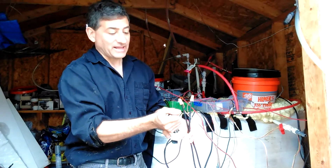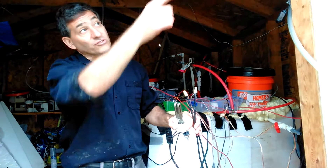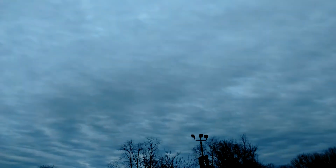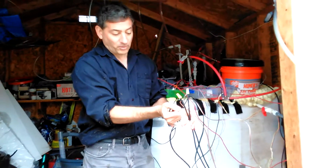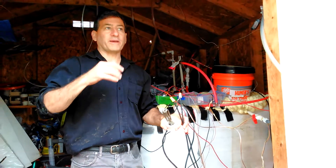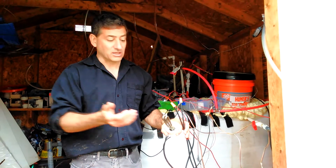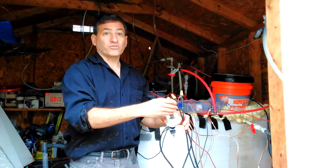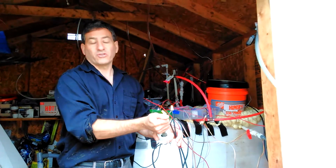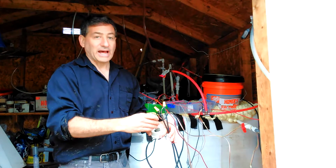When I touch this, even though it's a cloudy day, it's warm. It's not hot, but it's very cloudy — as you can see if you point the camera up there. There ain't no sun. So the fact that this metal coil is warm to the touch shows that even when the solar panels are maybe producing five percent — maybe only five or ten watts — you're still getting heat gain, which would be transferred into the tank. And of course when it's sunny, then you burn yourself when you touch this. It does get up to that full 60 watts and it's very hot.